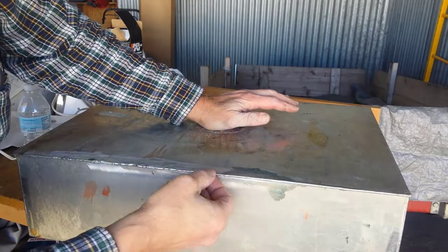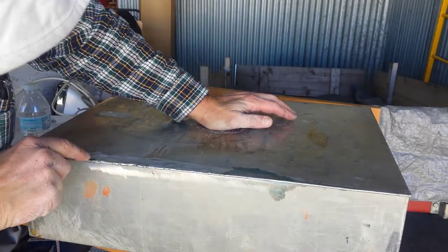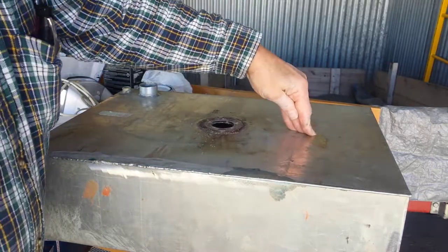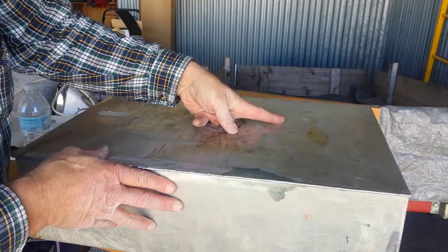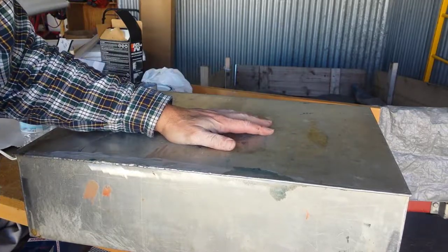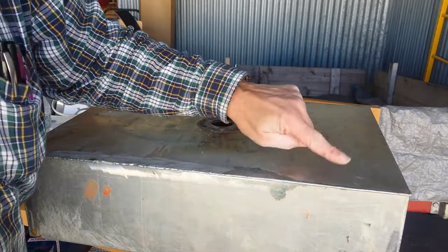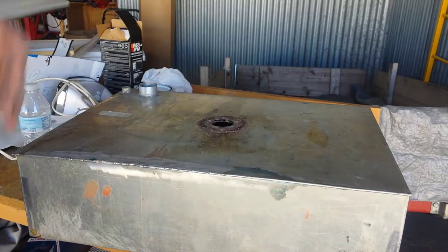You can probably see the blue stain — it was right here, right in here is where it's cracked. And it looks like there's a little seepage over here. This has been welded once before, it cracked before. My theory — you can see right here — the oil canning and poking around, I can get this section to pop up when I reach inside, just a lot of flexing. My belief is that we're getting oil canning as the fuel sloshes around, and that's flexing these joints. I really don't know how deep the penetration of that weld is. I suspect it's fairly shallow, but as that joint flexes, that causes it to crack. That's my theory.